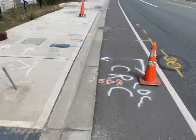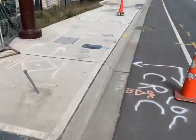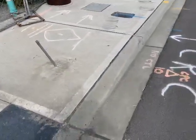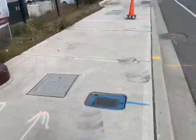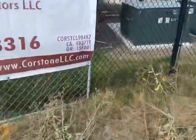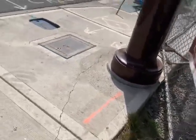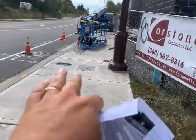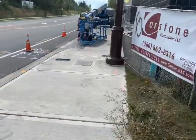So to summarize: three-inch grinding overlay, 20 feet of MMA fog line to put back, 20 feet of curb and gutter to remove and replace, and 18 feet of sidewalk panels to take out. It ramps up right here, so we'd saw cut right here and take out these three panels. The panels look like they're about six inches — the back side of the sidewalk looks almost five inches, but let's say six inches on these three concrete panels to be safe.